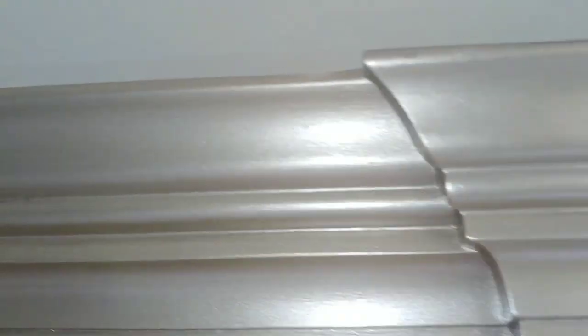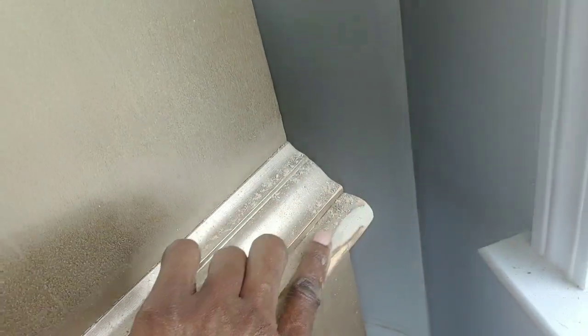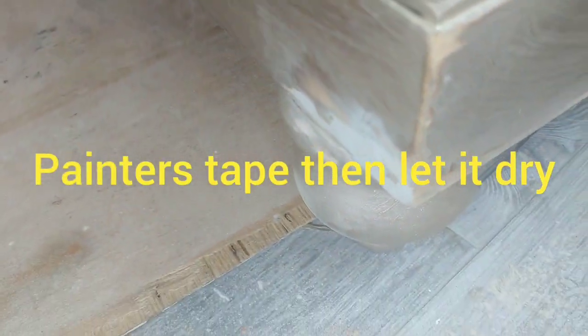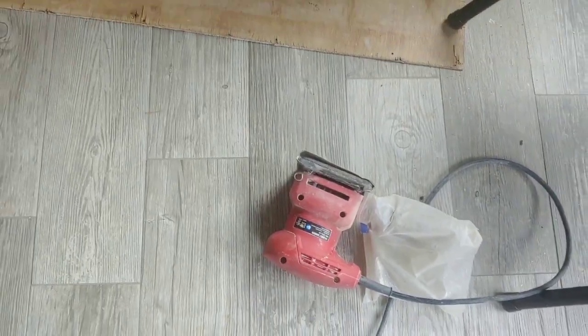This is where my damage was. I sanded only in the area where the damage was, put wood filler in, and used painter's tape to go around it to give me that edge. What you're seeing is just dust from the sanded area — that I should have done a year ago, but I did it. I put the wood filler in, let it dry for an hour, then went in with my electric sander, sanded it down, and now I'm buffing it out to make it smooth to the touch. It dried in an hour and I was able to sand and buff it.